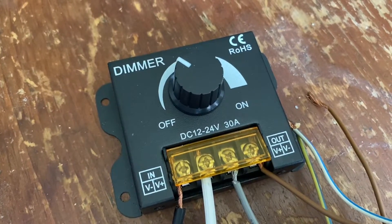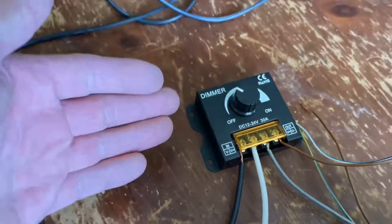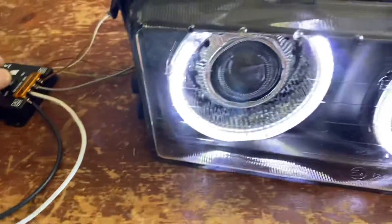You do need a special dimmer, because when you're normally dimming a light bulb, if you have a 12-volt regular bulb and give it six volts it shines at half brightness, seven volts a little brighter, eight volts brighter, twelve volts full brightness. With LEDs they don't really work like that. This dimmer actually turns the lights on and off super quickly — so quickly you can't see it — and that's what dims them.